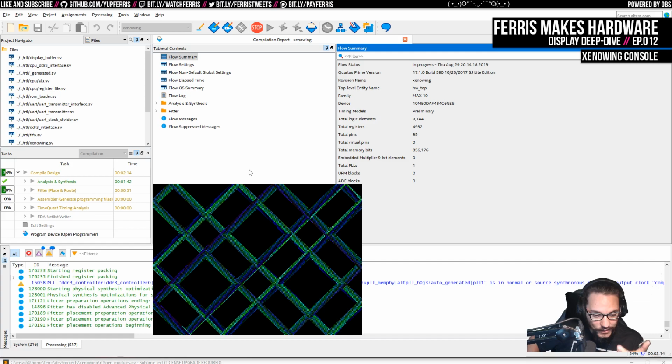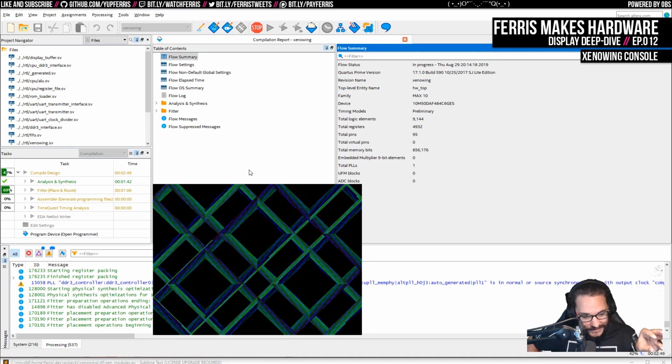And the way I do that is you take the UV and the upper bits determine where the texels are read from. So some of those bits become your row address and some become the column address. And then the lower bits determine your filtering factor. And I'm going to do everything in fixed point, but that's fine if we have enough bits. And from there, it's the same as you would do it in software. It's these 4 multiplies, which you can do in parallel. But the multiplies have, again, long latency, so we might have to split that between multiple cycles on this particular FPGA. But that's fine. So then a couple cycles later, we have all the multiplies done, and then we do a final gather for the add, and then we're done.